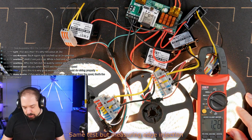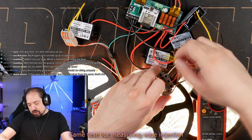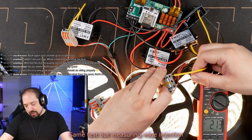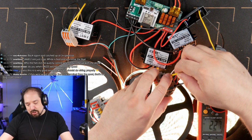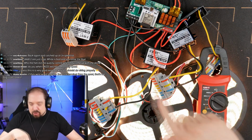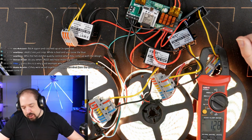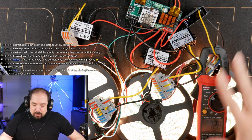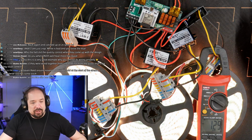Yeah, same is true here. So when I disconnect the middle injector that's close to here, you see that it starts using more power, but the amount of more power that it can actually use is limited by the voltage drop going over the strip. If this was a wire in between there, we might be overloading that wire, but since this is an LED strip which suffers from voltage drop anyway, the amount of extra current that will get drawn is pretty limited.